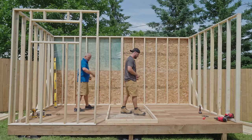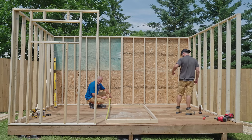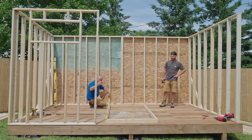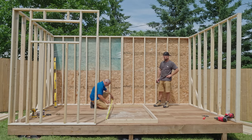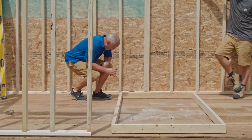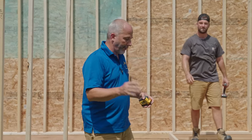We're going to start from over here, extend past the door and go wide with the wall section. First thing, grab a hammer and a nailer — drop a nail in the corner. We'll go with screws up there. Now it's not falling over — we're just going to level off and flush this corner.